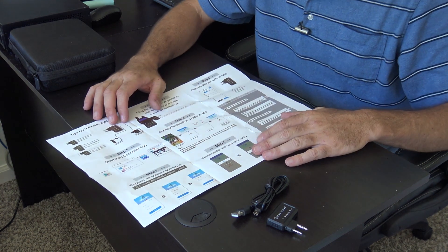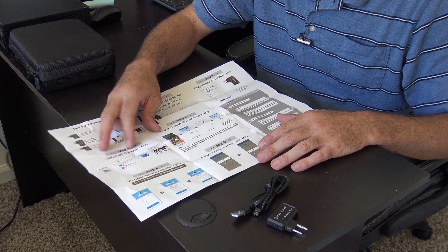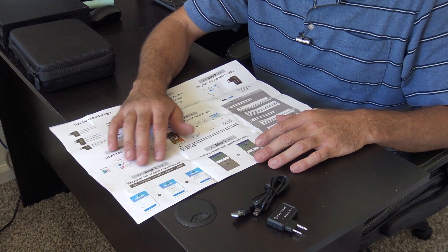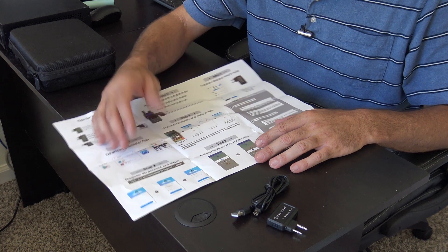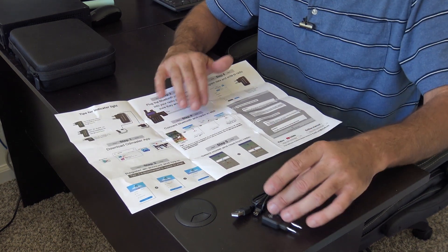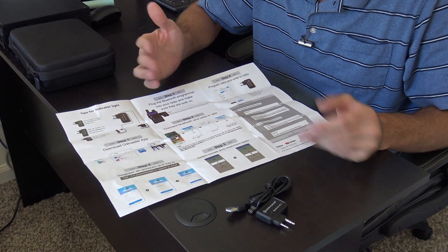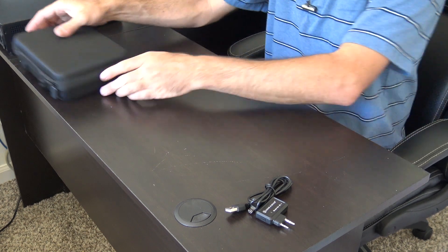It's very simple. Charge the device when you get it. Download the OD Master app on your phone or tablet. Register for an account — just a simple email and your birth date. Plug the programmer into your unit, connect via Bluetooth on the app, select the model, read from the radio, then you can enter your channels, frequencies, and tones, and hit write to program. It's very simple.